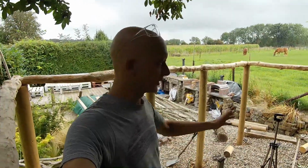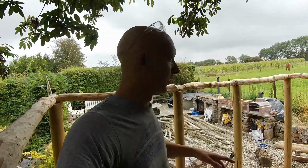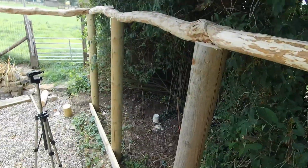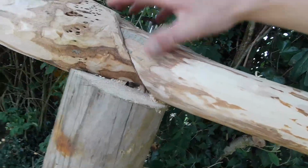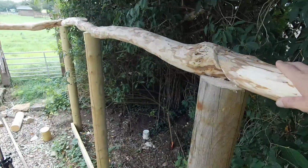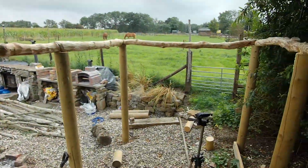There we go, we've got a strong ash frame all the way around the top of our poles now to sit our roof on. Now all of this has been hand stripped and I've done my best to fight the urge that I always have to do things quickly. So we've got some sort of joinery on here, see they're 45 overlap with a pin through with expanding glue in there, as well as heavy frame screwed down. So this is pretty secure.